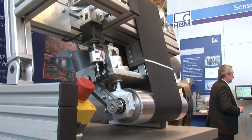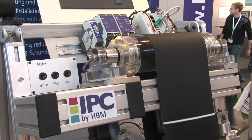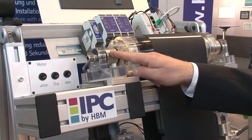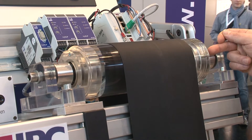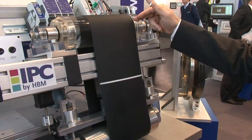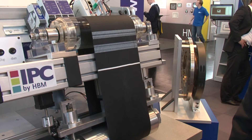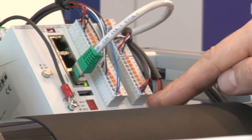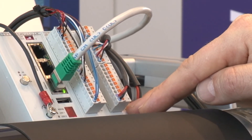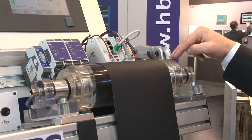What are the production cycles involved here? We see here the model and the reconstruction of a printing machine whose job it is to detect and measure the web tension and to regulate the drives intelligently. We see here the HBM bearing force sensors on the left and right side which measure the bearing force of these rollers. The web tension is generated through this simulated paper web. The signals are fed to the DigiClip measurement amplifier with high resolution and transmitted further via the CAN bus to a control, which regulates the drives and ensures that the paper web is transported at maximum speed.